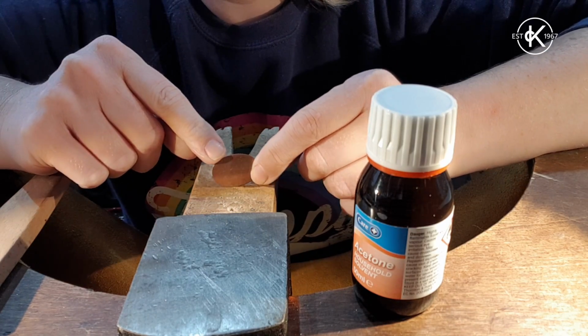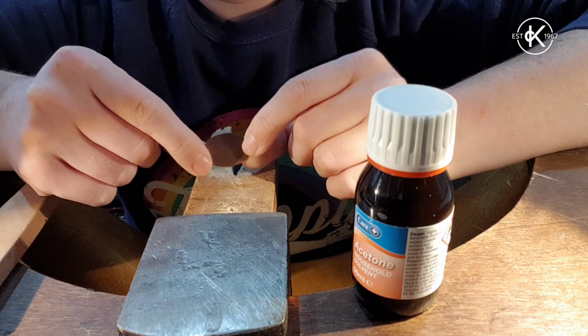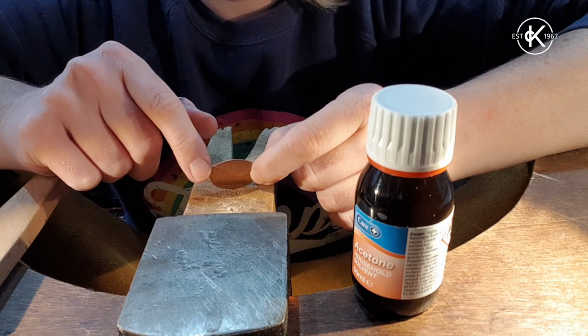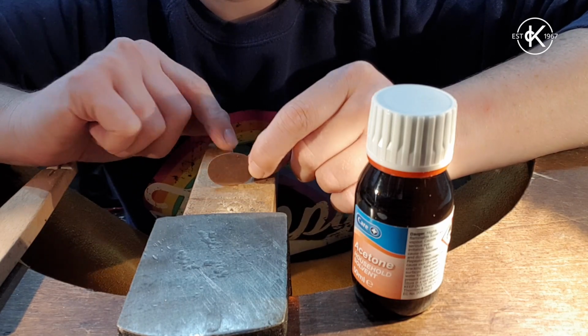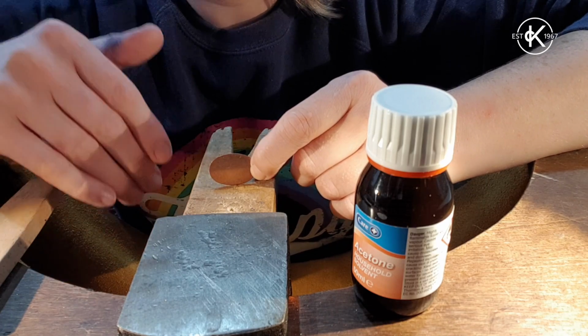before I put the resist onto it. Now I've got some little pre-cut shapes here. These are little copper ones, but generally speaking, you don't always want to highly refine your edge before etching, because there's always a chance that the etchant could nibble away at the edge slightly and you're going to end up having to refile and resand again.